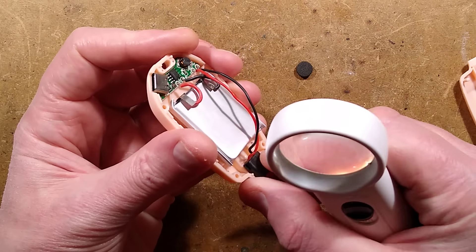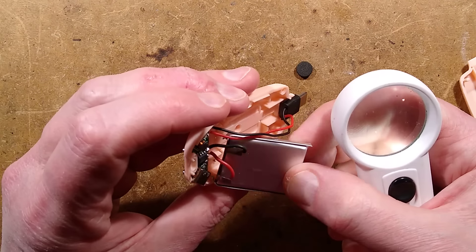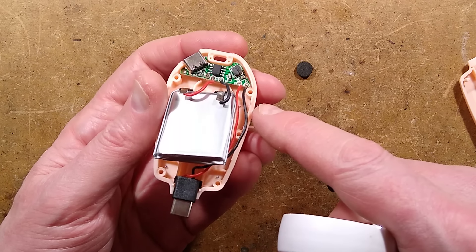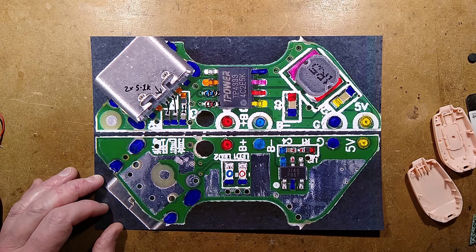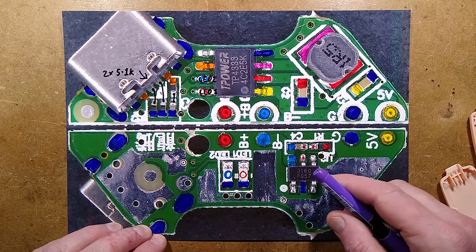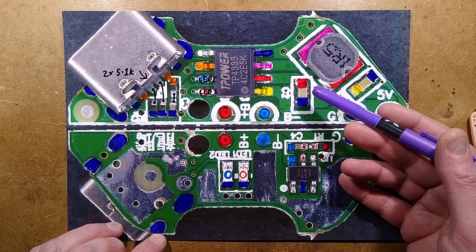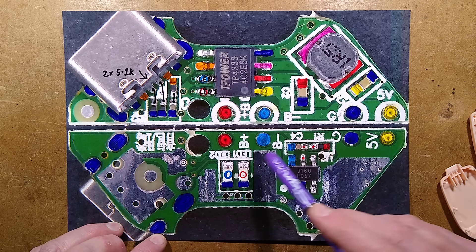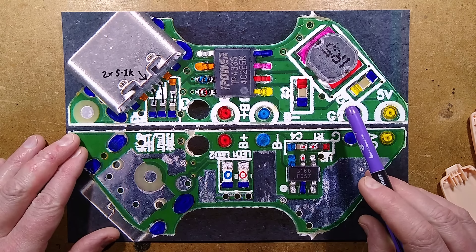Now look at the lithium cell — it's anonymous. I'm going to take the circuit board out and analyze it. Now we know kind of what the problem is. I have to say I'm feeling quite bad for the manufacturer, because somebody in the factory soldered these on back to front. But other than that, it's a textbook circuit — it's following the datasheet of this chip, the power bank chip, to the letter. And it's also got a dedicated little lithium cell protection circuit on it.